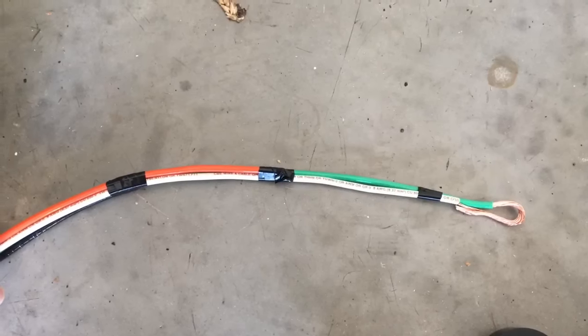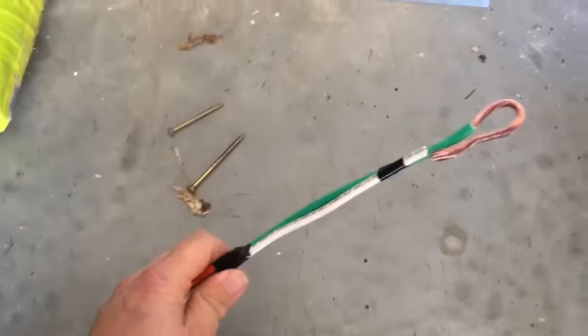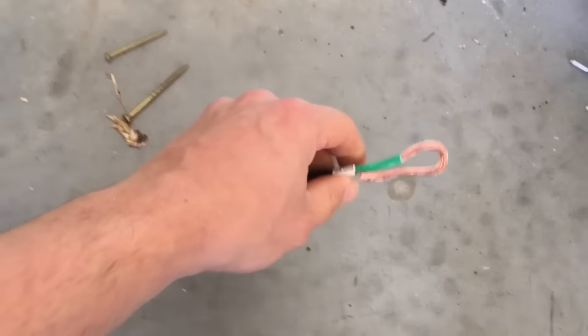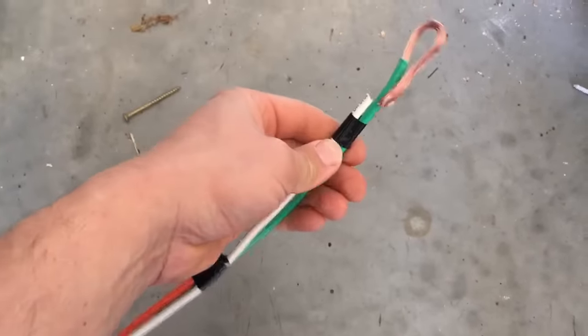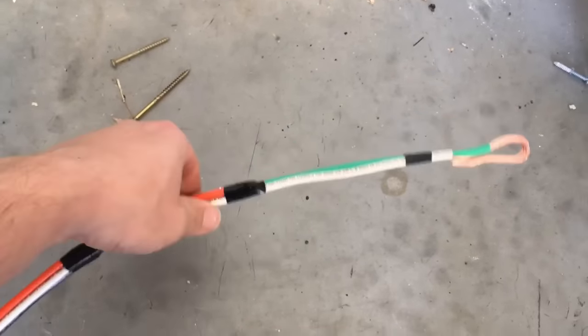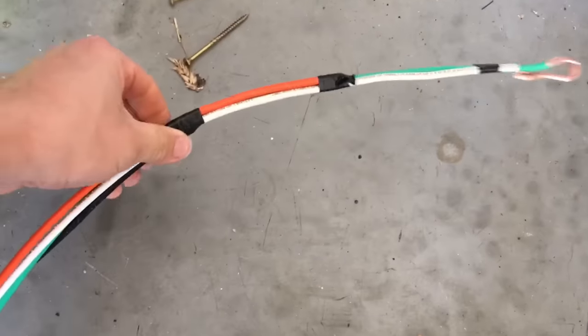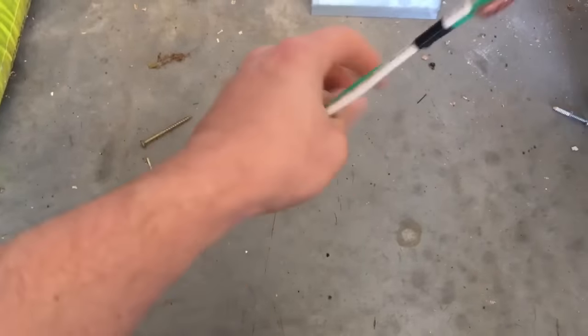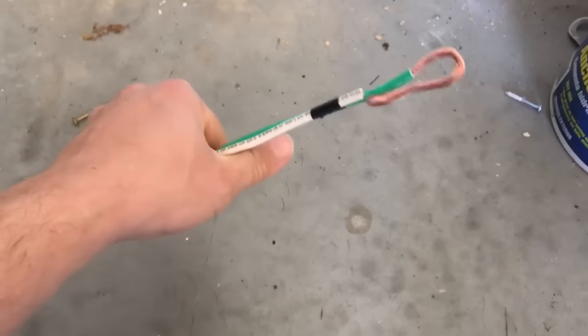This is what's called a head — it's just a stripped-out piece that I tape up. I put one piece of tape on there to illustrate what I'm doing. I'm tapering where the wire is attached to the pull wire so that it has a smooth taper instead of one big bunch right after the pull wire, so it doesn't get hung up.